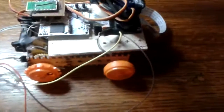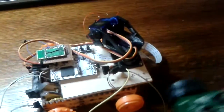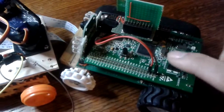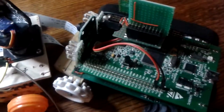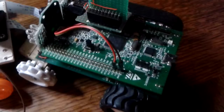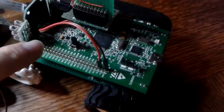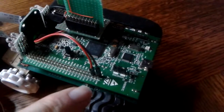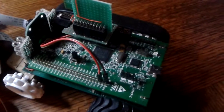The other big thing we worked on was, if you guys remember, there were these little blinky lights that blink all around while the thing's running, and it turns out that was causing a lot of interference in the video feed. So the video feed is now much improved while it's running. I made it so that the lights, instead of blinking each time a picture was sent, received, or buffered, just turn on the blue light and stay on, which makes a lot more sense.